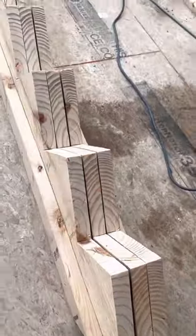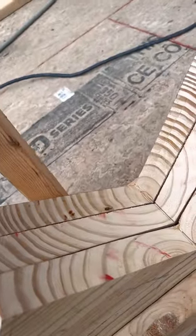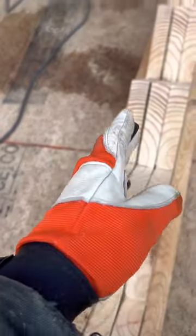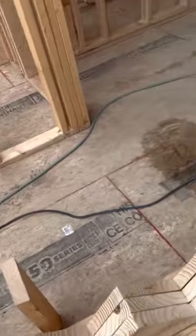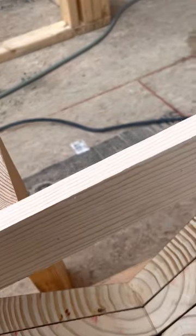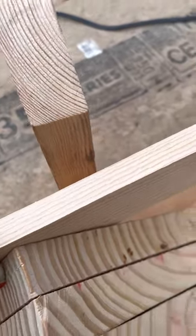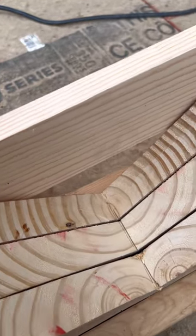So here's my three stringers, got a 2x4 nailed to the side, and that's solely to make room for, if you can envision the studs, the framing there. They want to be able to slide the drywall clear past the stringer. They don't want to have to notch their drywall around this. They can just cut it in loose, slide it in there. So you got your drywall, which is 1/2 inch or 5/8, and then they'll put their trim stringer on, and that's another 3/4. So it ends up putting you at about 1.25 inches, 1.375 inches, maybe a small gap, which you can either caulk or put your finished stringers on.